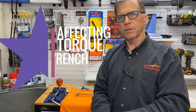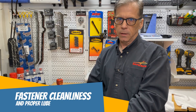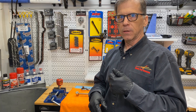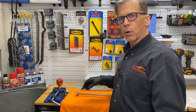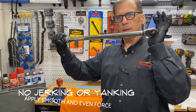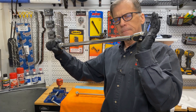What affects accuracy when you're torquing? A bunch of things. The number one thing is the cleanliness of the fastener — the bolt, the thread holes, and any dirt in the material. Lubrication on the fastener also needs to be the proper lube if you want an accurate torque reading. Technique matters too: you don't want to jerk hard on it; you won't be assured the fastener is actually being stretched correctly. Approach the target torque value as slowly as possible.